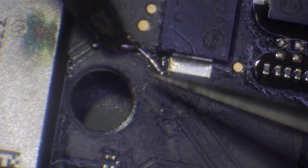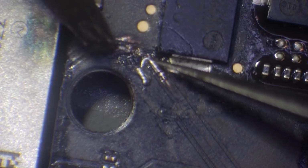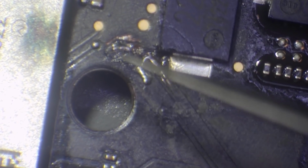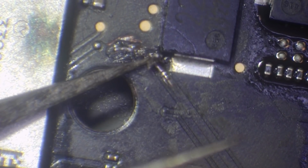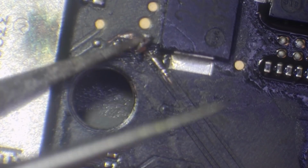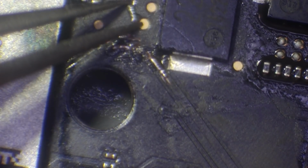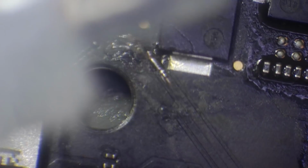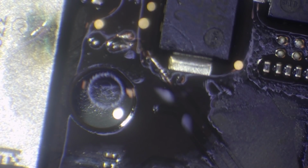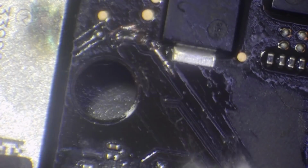There we go, just break that jumper wire away. And just a little patch wire there. Let's just make sure that's not shorted to ground. Interesting. Just get rid of that jumper wire for a second. Alright, there we go. Hope that wire didn't go to somewhere. Not the wire, the test point. He's probably fine. But that's interesting. As soon as I run that jumper wire, we had a short to ground. That would probably explain why that trace has burnt away in the first place, wouldn't it?